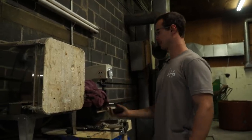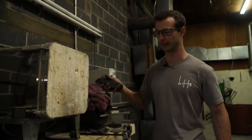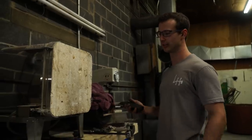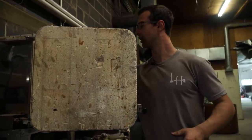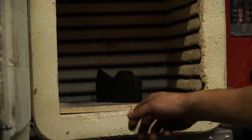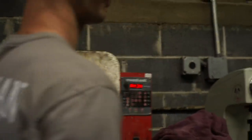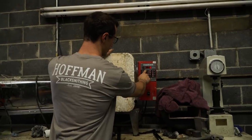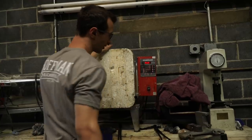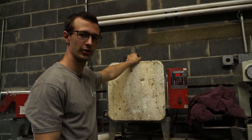Story time's over. Go ahead and throw this in the oven — this is the really boring part. It's not like on Forged in Fire where someone takes it out at welding heat and dumps it in oil for two seconds while it's still red-hot. We're going to use a heat treating oven and do things the right way. This is a 4140/4142 steel axe — that's what I use for all of my axes. I've got pre-programmed programs on this; program one is for hardening. We're going to run that, let it cycle up to temperature for the quench, and come back in about an hour.